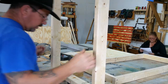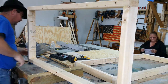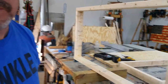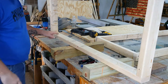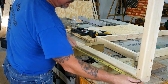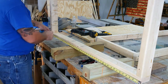Okay folks, so I got a little bit ahead of myself. I got so excited, I forgot that one of the tricks I want to employ with this is pocket hole joinery. I'm going to put pocket holes in the edge here, make sure you can see again, in here all the way along to hold the top on. So basically what I'm doing is measured from the outside to outside, just for easy math, then went 6 inches in all the way across, divided it every 6 inches.